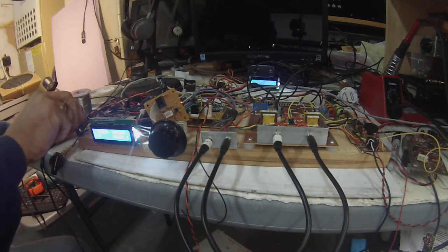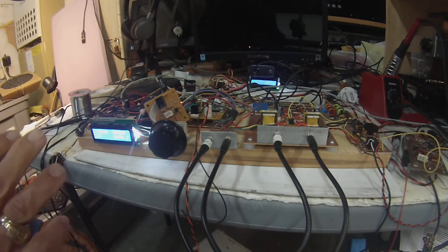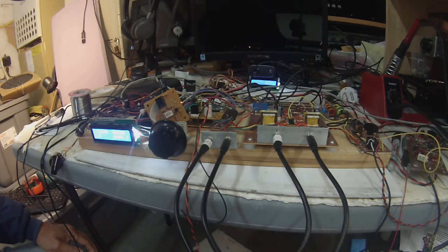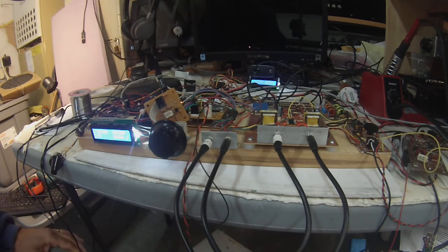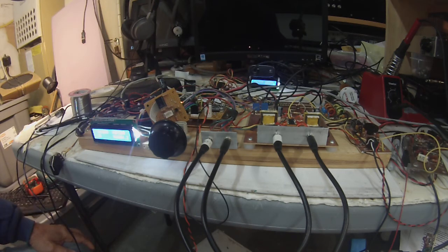7163. So this functionality essentially will give you somewhere downstream 2 displays, a color TFT to look at the spectrum, and then the simple LCD to just give you the frequency. And there'd be a way that as I shift from upper sideband to lower sideband, a double pole, double throw switch would take the other set of contacts and essentially drive the Uno to just show the display, would say upper sideband or lower sideband. Wouldn't have any real control of the processing, but at least give you a visual display.